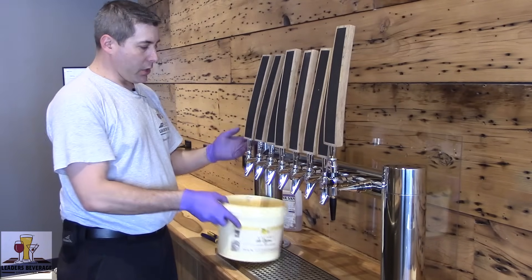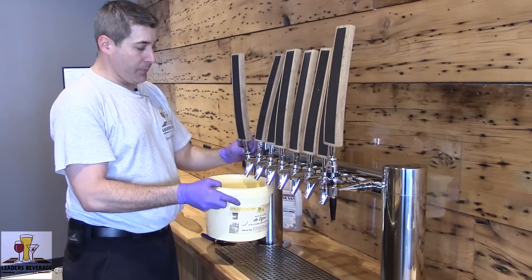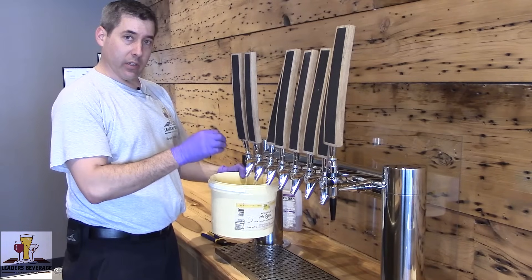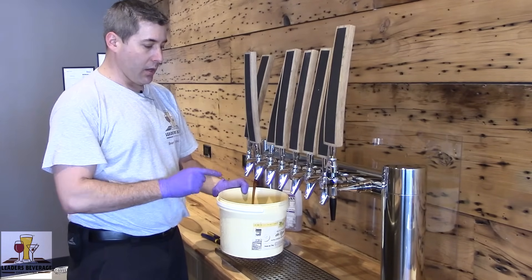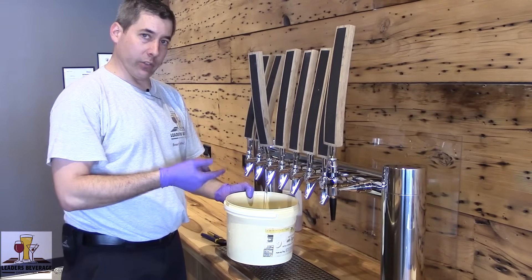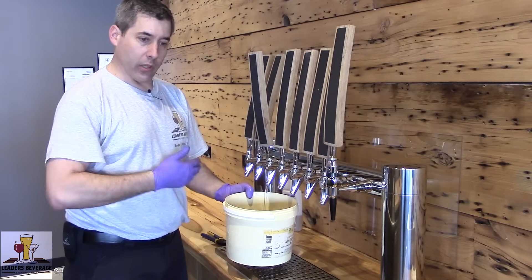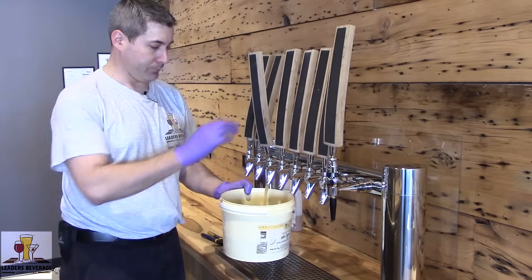Everything is re-engaged in the cooler. We're going to run the beer through until we get to beer and run out a little bit, to make sure the lines fill back up so the bar is ready to go, and to check flow rates. Once we turn the glycol back on we'll have freezing glycol going through the system, so we want to make sure there's no water left that's going to freeze. We bleed all these out, then clean up the area and mop the cooler — cleanliness is next to godliness. Thanks for joining us at the Open Bottle today where we did a circulation cleaning. If you found this video useful, please like it, subscribe, or leave a comment. At Leaders Beverage, our passion is your next drink.